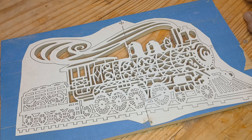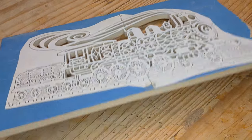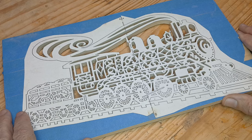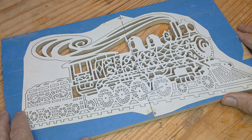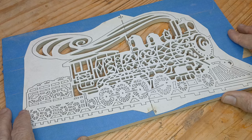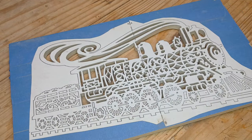The point of this video is why I choose the blade I do. My first criteria generally is the size of the area I'm going to cut, and also in consideration the thickness of the wood and the density of the wood. A dense wood — a purple heart or an oak — will burn a small blade up if you push it too far. But you can make some small cuts in thicker, dense wood if you're very careful and take it easy. I don't like to push a blade like that because I've broken more than I can count. The three criteria: first is the area I'm cutting; second, the thickness of the wood — the thicker, the bigger the blade; third, the density of the wood — the more dense, the bigger the blade.